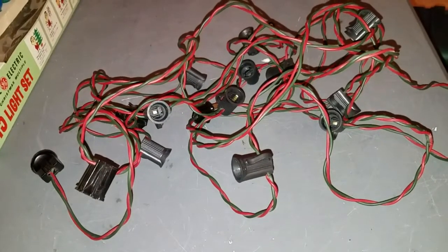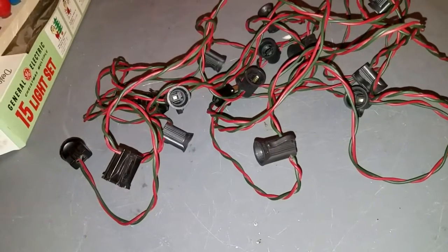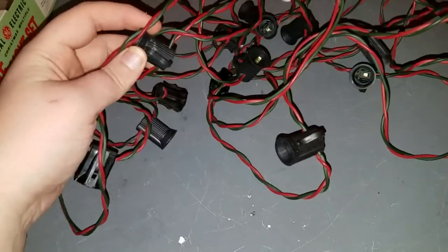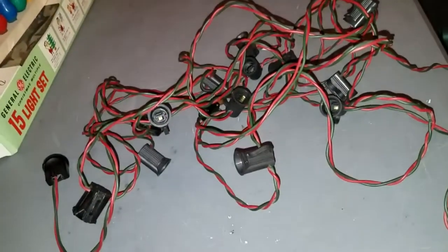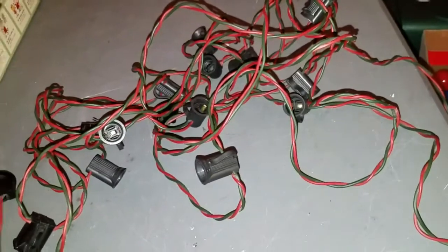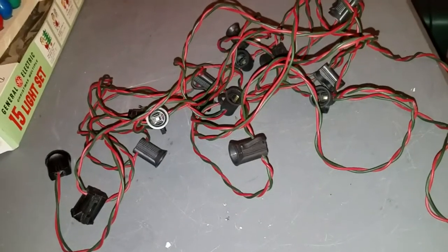This almost seems dangerous. And that was before I learned that most C7 and C9 sets, even modern ones that you can buy today, are manufactured in this manner, using little spikes to drive into the wire to provide power to the socket. So I removed all the bulbs from the socket and just put it away. I actually planned to just call it a loss and use it for scrap wire for random projects, because I'm not going to use this set. I don't feel safe using a set with most of the sockets having an electrical connection issue.